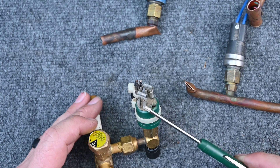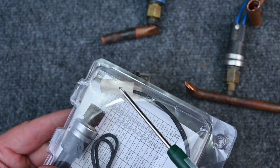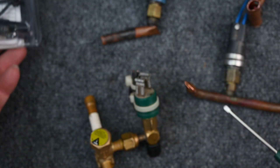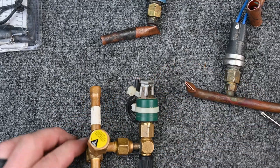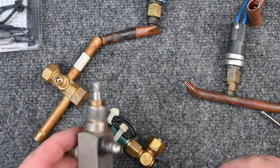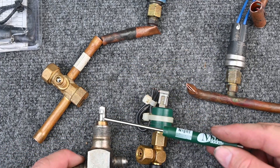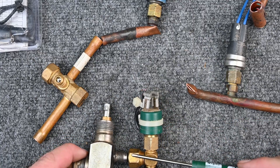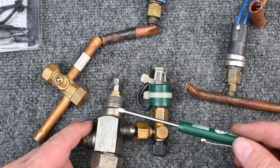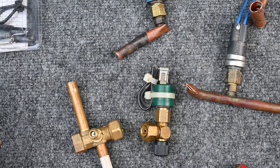This particular switch wouldn't be ideal because it has exposed wire connections that would be outside the cabinet. A better solution uses a pressure switch with sealed/closed connections — no exposed connections at all. You'd run the wiring up into the electrical compartment where it's protected. This works really well with basic service valve ports. The problem is with a three-way service valve — you're at the mercy of the last technician remembering to keep it mid-seated at all times. So I do not like to use this T-fitting method with a three-way service port.